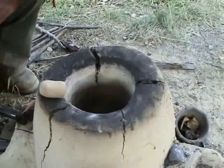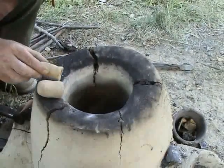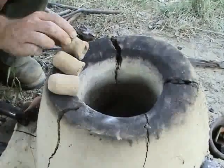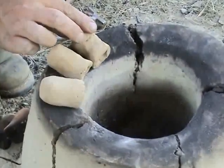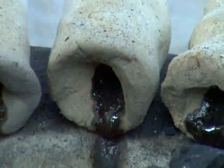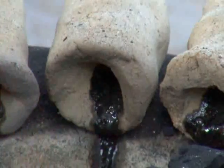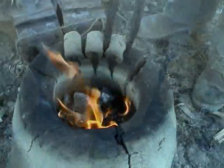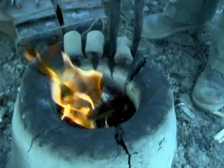The green molds are left for a little while before they are placed onto the hot furnace rim, the funnels facing the heat. Wax issues from the molds as they are being dried. After drying, the chemically combined water needs to be removed. This is done by firing the molds for a couple of hours at approximately 900 degrees Celsius.